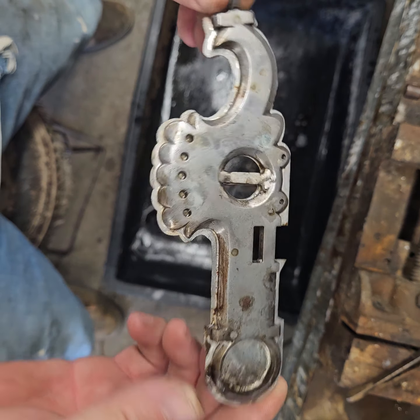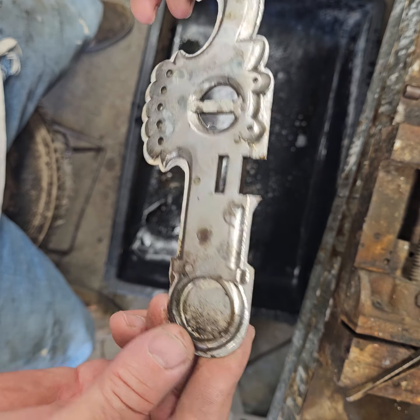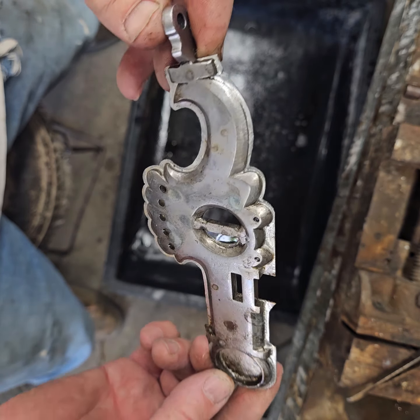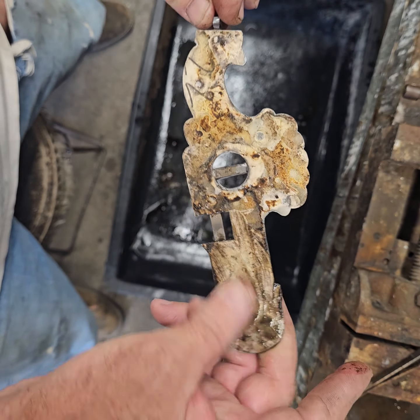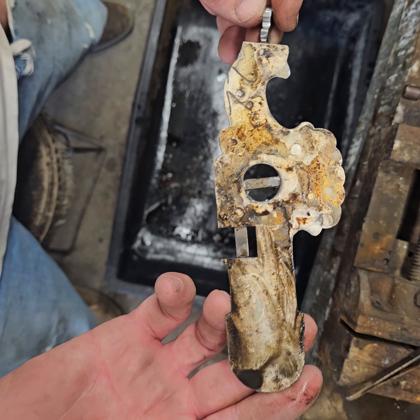Before you saw all that excess silver off the edges, now's a good time to check to see if you have a good solid solder joint all the way around to keep this silver from falling off the cheek. It's a bit of a mess on this side, but it actually comes off real quick. I'll go clean it up with some steel wool and soap and it'll be ready to go from there.